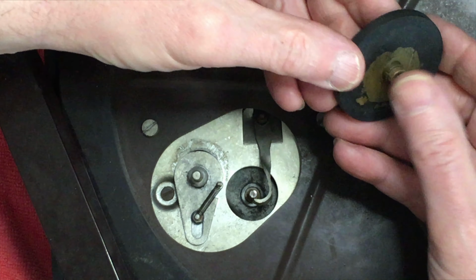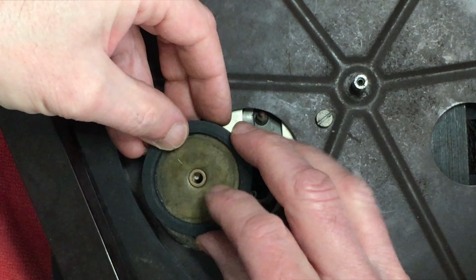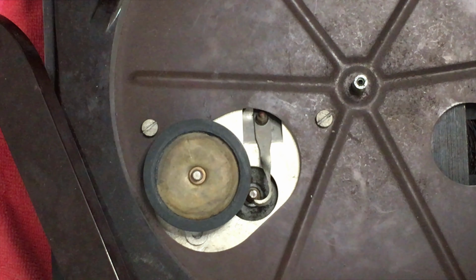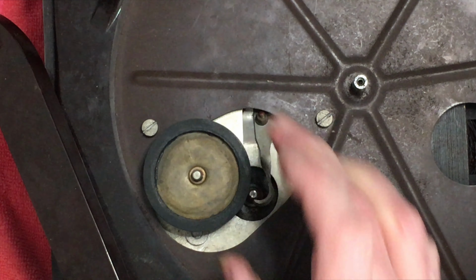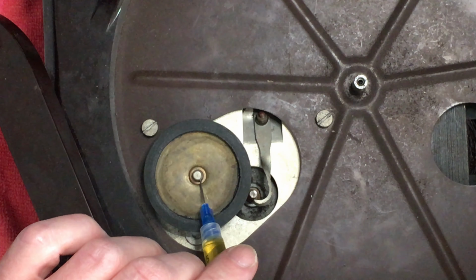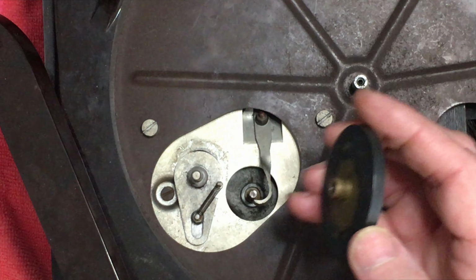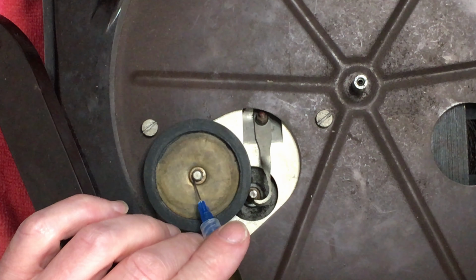And this is a fixed bush, there's no felt. So although it will hold a tiny amount of oil internally, it's not a lot. And that has got a bit of slop on it, it's a slightly different shaft size to wear. So it definitely needs lubrication. If the bush is dry, some of that should soak into the pores. It's not gone through to the bottom of it, so we'll take a bit more.